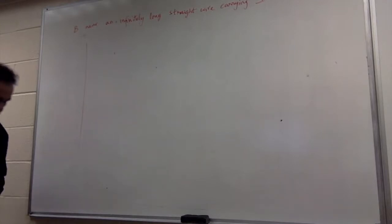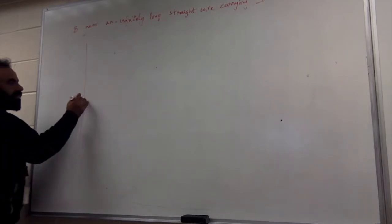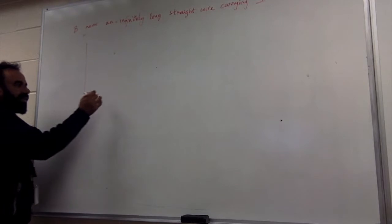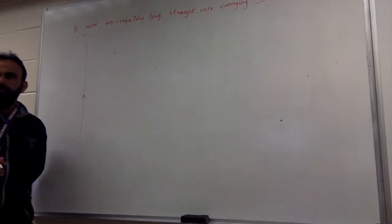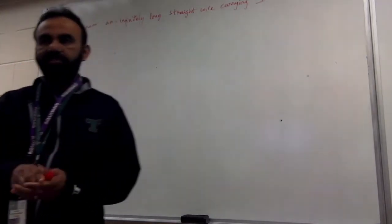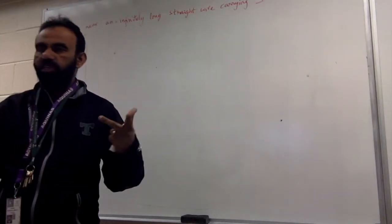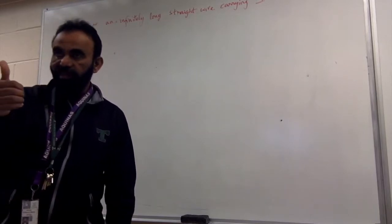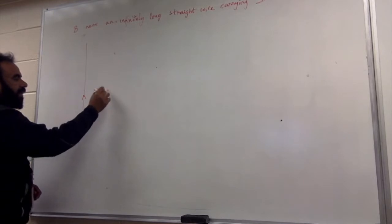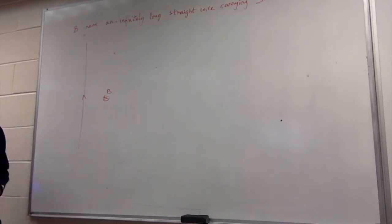The magnetic field near an infinitely long straight wire carrying current is what? So if you have a current going in this conductor in that direction, which way is the magnetic field here? The moment you are given a question asking for directions, you need to use these rules. Like this is the right hand grip rule, immediately use it. Okay, so which way is it? In.